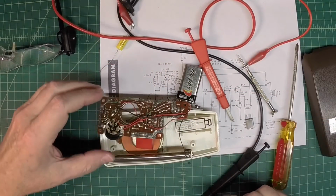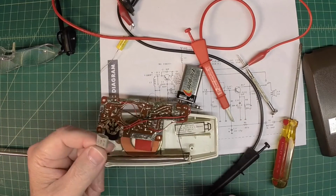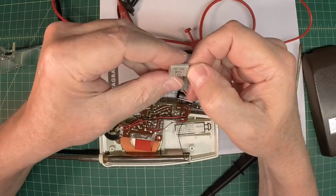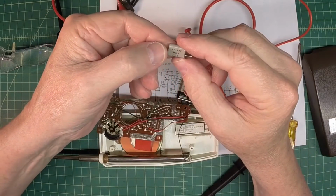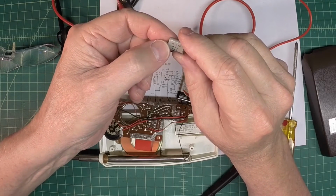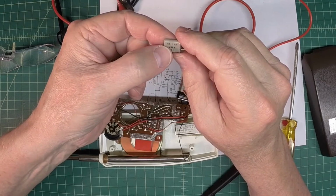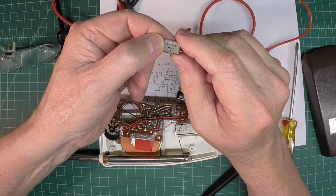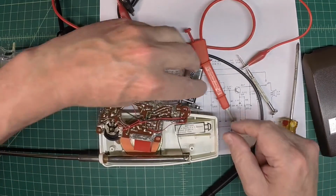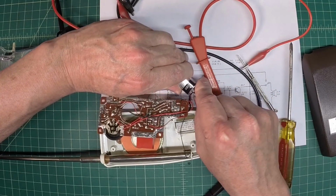Okay, a little additional troubleshooting here, and what's wrong with the oscillator circuit is nothing more than the crystal, best I can tell. Many years ago I used to do, I think I mentioned it earlier, CB repair. So I had a leftover crystal in one of my old parts drawers that I dug out. So that's what appears to be wrong. You can get this battery hooked back up.